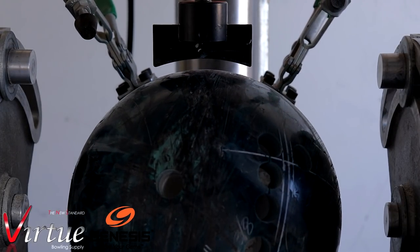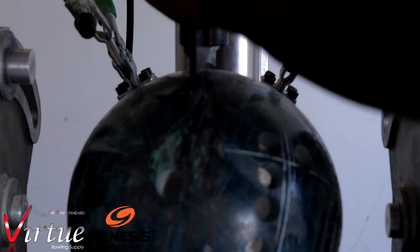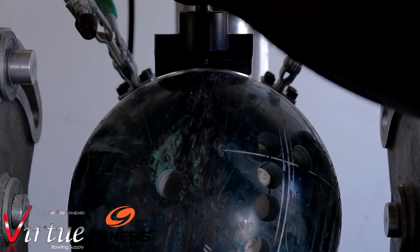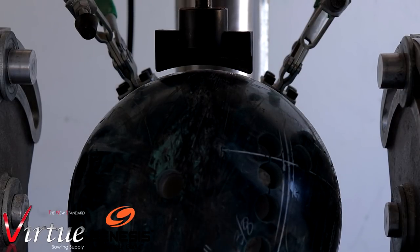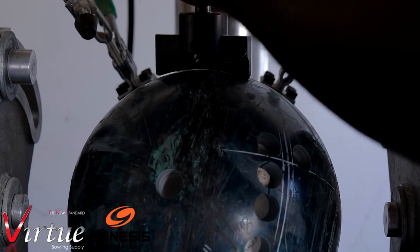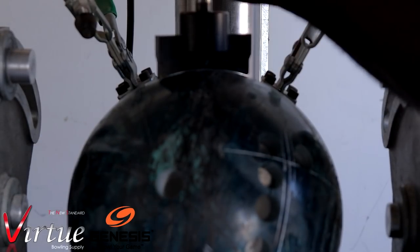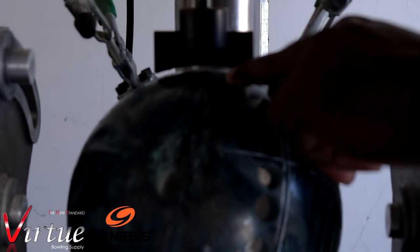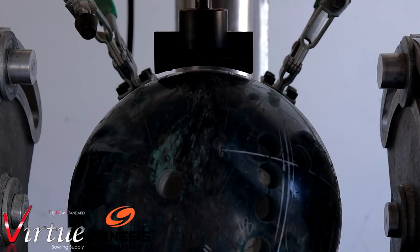So you wanna put everything on zero on your jig, get a plug cutter, check front, back, left, right, diagonal. Make sure that the ball is touching equally all the way around. Now, a lot of shops may not like this, but hey, if you ever get a ball plugged and it's gouges here or whatnot while it's spinning, the only way you can gouge one portion of the ball without the other is if your drill press isn't in alignment. It's just that simple, because that's a perfect fit. So if you're digging deep here and that's not touching, your machine's out of calibration. Sorry to say it, get it fixed.